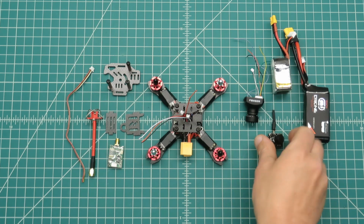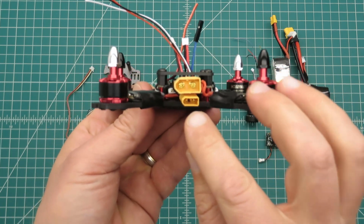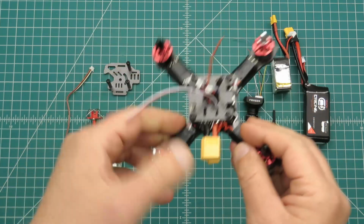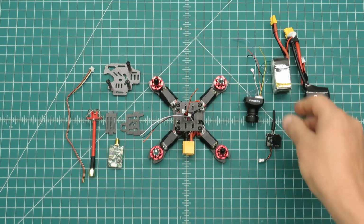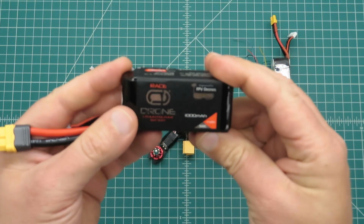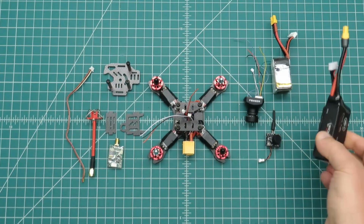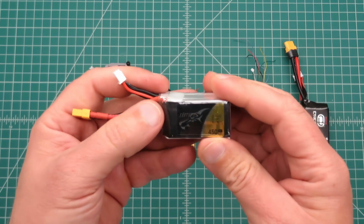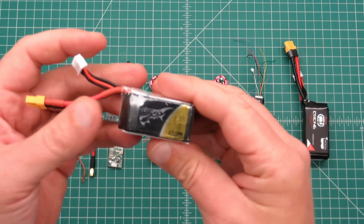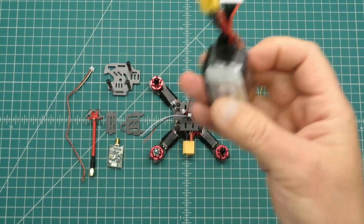So I'll use that as part of an ultralight build, and I don't know if you noticed a second ago, but I have also installed an XT30 connector in parallel to the XT60 connector. That's just kind of for the experiment. That's going to allow me to use the standard battery with the XT60, again a 4S 1000 pack, for the standard build, and then switch for the ultralight build, along with this small camera, to a 4-cell 450. Of course, it's got an XT30 connector.